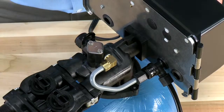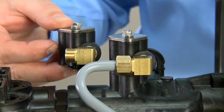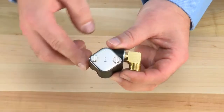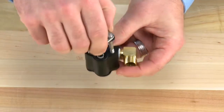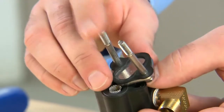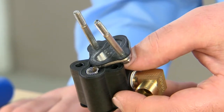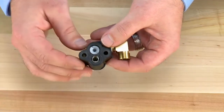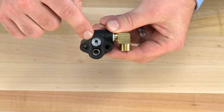To make this easier to view, we have removed the assembly from this valve to show the intricacies of the parts. We begin the disassembly by removing the two screws from the cap. On the bottom of the cap there is a gasket. We want to check the gasket to make sure that there are no cuts or damage to it — it would need to be replaced if there is damage. We then have access to the screen and two-piece injector assembly.